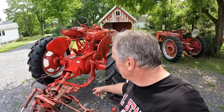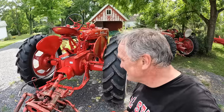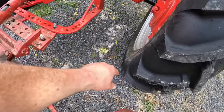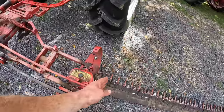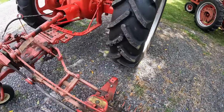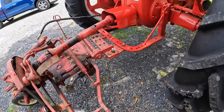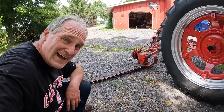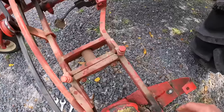It's about four hours later and I got the hitch hooked up and the hydraulics working right. Everything on the MD has to be difficult — it's not like the H where I just bolt up and go in ten minutes. I had to move these plates to the underside of the hitch because the mower was riding up too much; this hitch is higher because I've got bigger tires. The inside shoe isn't running where I'd like it — right outside the tire — but I've got a wider stance on the M so that's the way it's going to be. What I can't deal with is I've changed the angle of the cutter bar and need to adjust that.